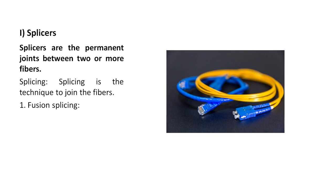Just as welding is used to join iron pieces, similarly two fibers having the same size and same core refractive index are taken. With the help of a micro arc lamp, a flash of light is incident on these two fibers so that the two ends get melted and fused together.